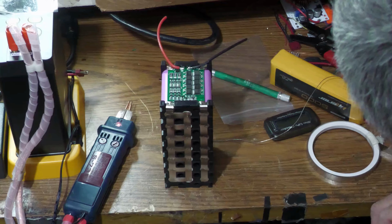This whole line here is the first string, and it's connected on the top here to the second string. These are all connected on the back, so that you have this coming over, and that gives you the 8.4 volts. That gives you the second string that attaches there, and then this is the last string. So you have the one single here going to the 12.6, so this is the very end. So it's fairly straightforward when you do a 3S configuration.